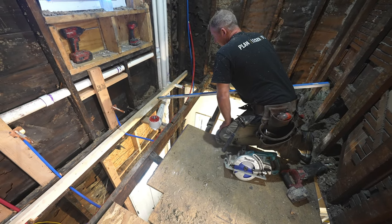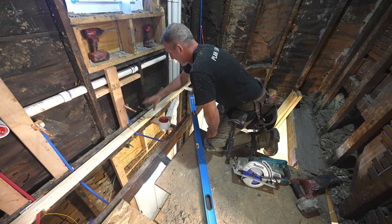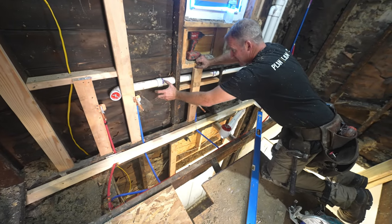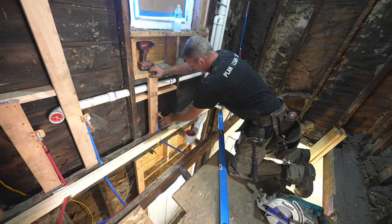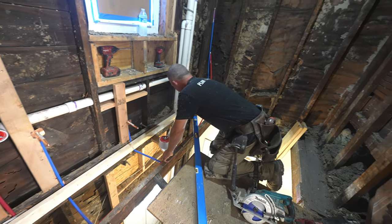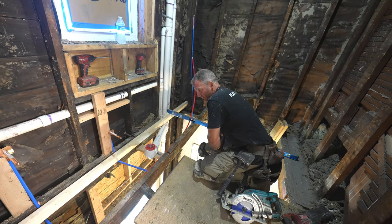When we put our ledger — I kind of already created a ledger here — since I furred out my wall we didn't have any surface for the flooring anymore. I furred this out because I wanted to make sure I have my vanity supplies on the outside wall so it works really well with my freestanding vanity. I always like the toilet supplies on the wall rather than coming through the floor. So I got this ledger, I notched it out a little bit, and the first thing I'm going to do is get this ledger completely level.